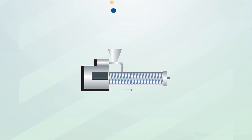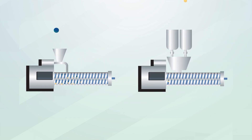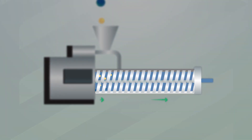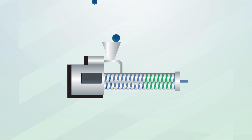The API and other excipients are either pre-blended and fed using a single feeder, or split-fed individually into the throat of the extruder. Most commonly, a co-rotating twin-screw extruder is used that imparts mechanical and thermal energies into the mixture in a highly controlled manner to facilitate solubilization of the drug molecule.